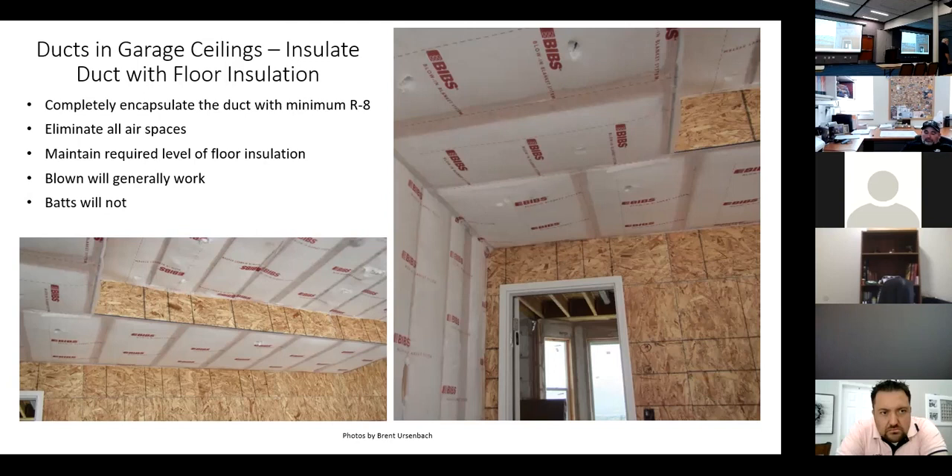It's a pretty good-looking job — they've done a great job insulating that, and guess what: the builder found out it works. The theory is to get insulation all the way around, make sure there are no voids where cold air can migrate from outside. It costs maybe a little bit more than batt installation but it's so much better. I've become a big fan of this type of insulation over the past few years — I've gone around with a thermal camera and seen what it does. Great product.